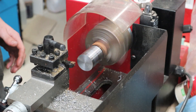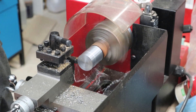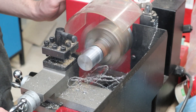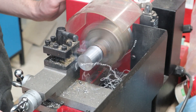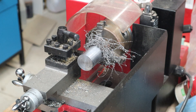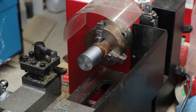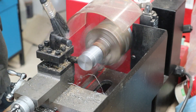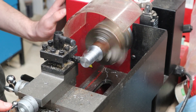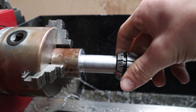It was time to turn the part down to about 20 millimetres in diameter, so I turned on the auto feed and was taking about a quarter of a millimetre cut on each pass. I had the lathe speed going pretty fast as carbide tooling likes faster speeds. These first passes went really well but then something went wrong. Once I cleaned it up I got back into it and it was taking really long stringy cuts — some of them over a metre long. To stop this I moved the compound back every second or so to break the chip. After a short while I turned the part down to just under 20 millimetres and tested it out on a 20mm collet with a perfect fit.